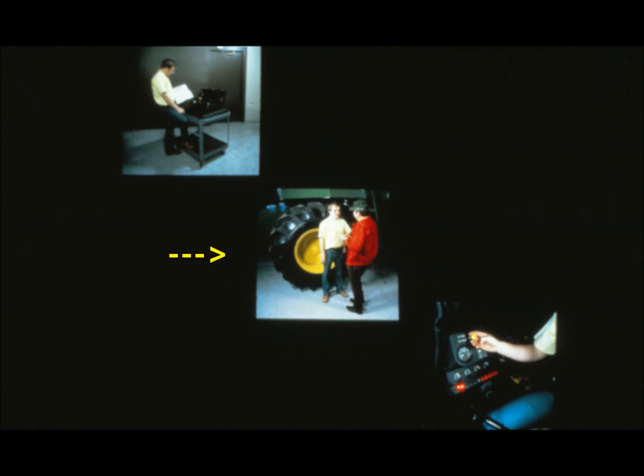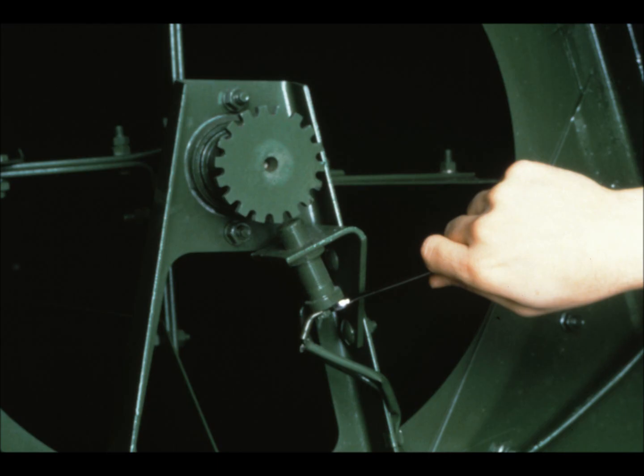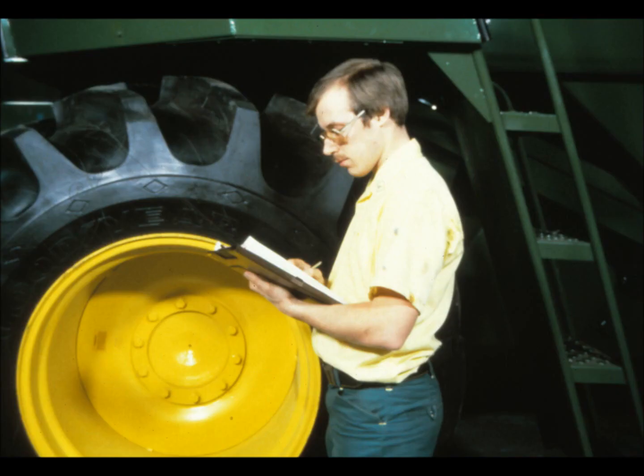Next, operate the machine yourself to help identify the problem. Fourth, inspect the machine—specifically the malfunctioning circuit. It's surprising how often a seemingly big problem is caused by nothing more complicated than a loose connector. This visual inspection is a lot quicker than testing the system. If that doesn't prove out, you will have to go into the system, listing the possible causes as you go, eliminating one potential trouble spot after another, finally reaching a conclusion, and testing the conclusion.